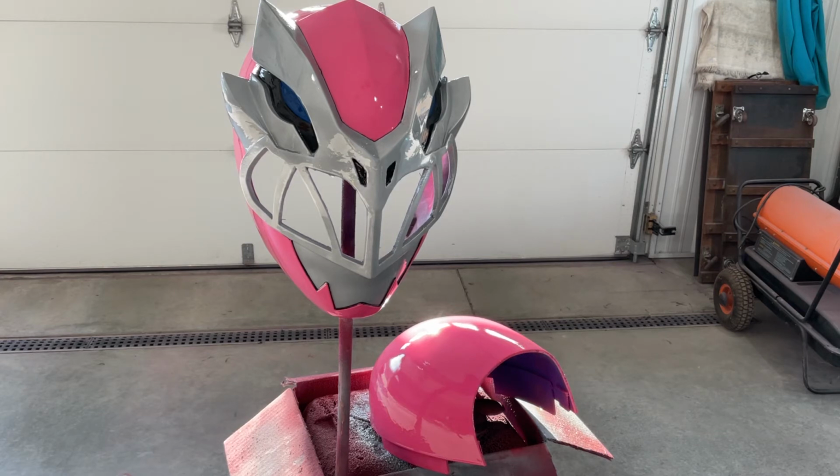I was working on SPD blue for a customer, and for some reason, the second coat of clear just started bubbling. So I let it dry. I sanded it all down with like 1,000 grit. Well, I started with 600 wet, and then up to 1,000, and then I re-glossed it, and it is pretty. So it's salvageable. Definitely gonna think about what to do with the back. Again, we gotta let it dry and see what it looks like. It's hard to tell, but everything's still kind of wet. But that's the game plan, and see you at the next step.